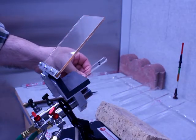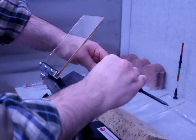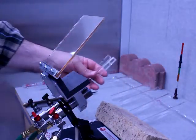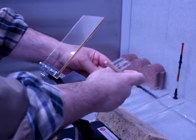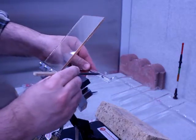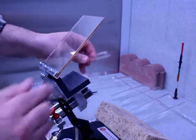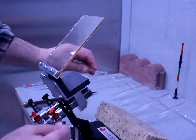What I'm going to do in this video is make the dimples that are used to seat the inner tube for the bubbler or condenser. I basically want to make another set of these insets so I can modify them or make multiple condensers without having to keep pulling them out. I've made two marks on either side. I'm going to heat it really hot in one spot, gently push to get about halfway, flip it over, and then do the same. Normally you'll see it divided into three in many cases for glassblowers when they do this technique. In this case I'm not going to overthink it — all I need is just a small indentation to seat this.